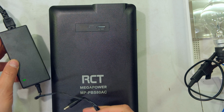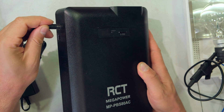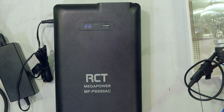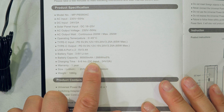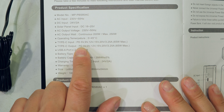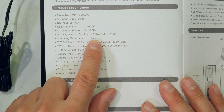I've now plugged in the charger — there's a green light telling me it's on — and plugging it into the power bank, it immediately starts charging. It takes quite a long time to charge; according to the manual it takes six to eight hours using the DC input. You can also charge it using the USB-C power delivery port. The operating temperature is between 0 and 45 degrees Celsius, which I can confirm.